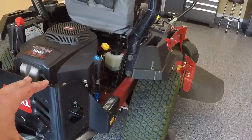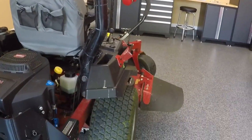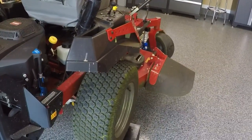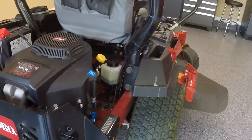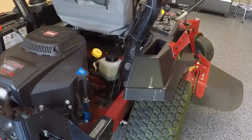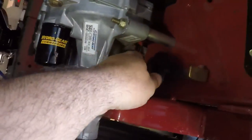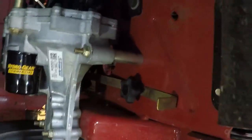A little over full right now, that's okay — still got to do the bleed procedure. It also states how to do it in the manual. You're going to want to get the rear drive tires off the ground because you're going to have to spin them under a no-load condition, so jack stands or something to support the back of the mower. Make sure everything is buttoned up and closed up. First, you're going to do the first part of the bleed procedure with the transmissions in bypass mode. Every mower is a little different the way you put it into bypass mode.